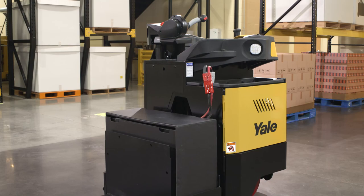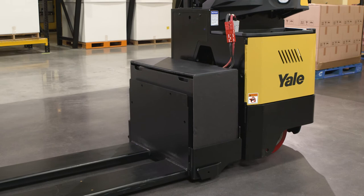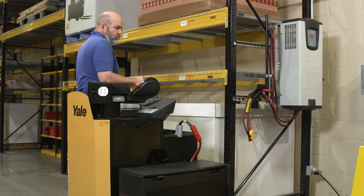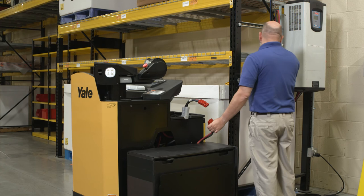The lift truck battery can be removed from either side of the lift truck. A roller rack under the battery permits easy battery movement. The battery must have spacers installed to prevent more than 13 millimeters or 0.5 inches of horizontal movement. The battery restraint panels must be in place before operating the lift truck. The battery can be left in the lift truck for charging with the open battery compartment sides. If removing the battery from the unit, we recommend having the proper equipment and training available.